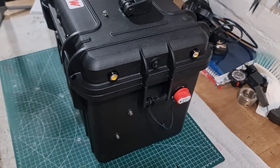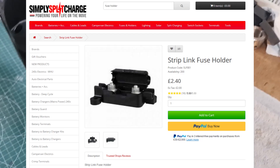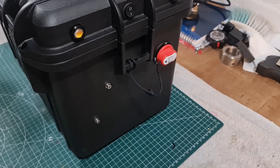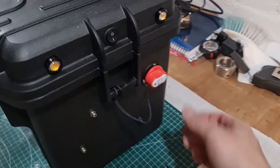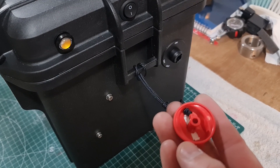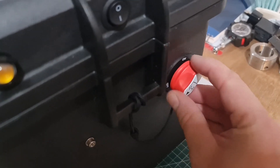Round to the far side, you can see we've got another two LEDs that are switched. We've got these two bolts here — cap screws, stainless steel — and these are actually holding the fuse on the inside, which I'll show you in a minute. You can see there's a little lanyard rope here, and that's actually holding the isolator. This is a 200-amp isolator — it'll do 300 amps short-term and is rated at 30 volts. I didn't know it had a removable switch, so I've put this little rope on here so I don't lose it. I've drilled a hole, put a bit of string through, put a knot on it. That's it in the off position — just in case it gets nudged, I'm not going to lose it and not have a power supply.